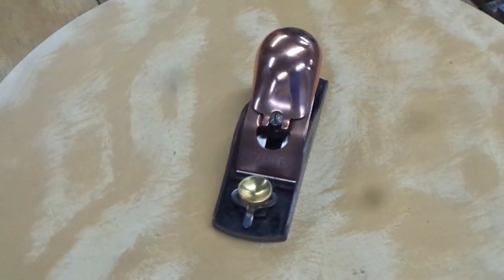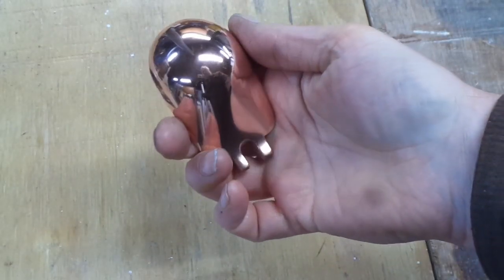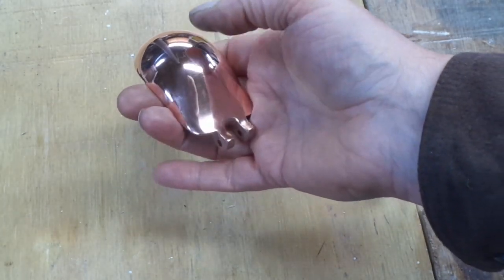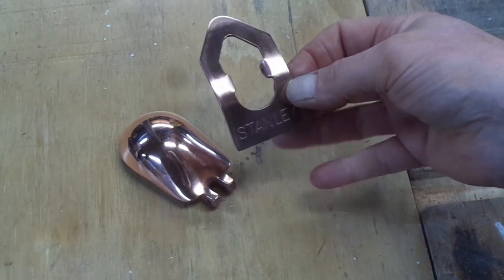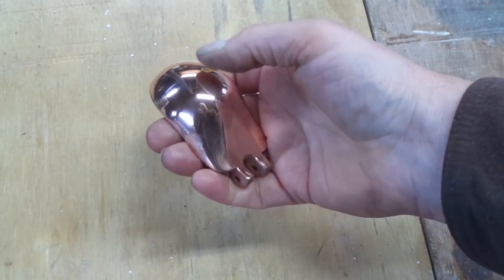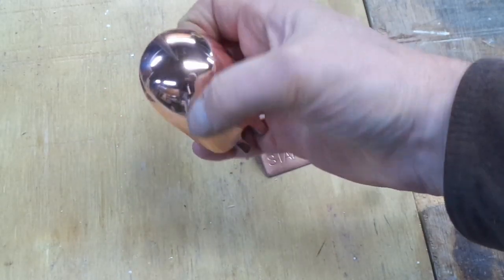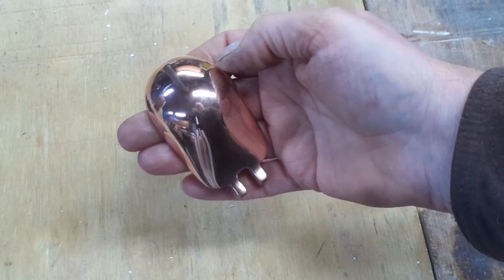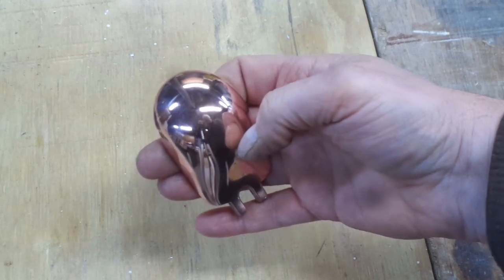Here it is partially assembled with the copper on the lever cap — I think it looks kind of cool. I've been at this piece for two or three weeks, and hopefully you can see the reflection of the lights — pretty close to a mirror finish, and I'm good enough with that. I didn't record a lot of the steps because they weren't working very well, and I got tired of recording things that didn't work. But I'd like to summarize what I learned. Originally I had some pits, and I thought the copper plating would fill in the pitting — it did, but it turned out to be quite an endeavor. If I had to do it again, I'd spend a little time sanding the pits out of the steel before moving on.